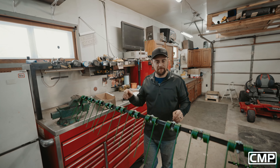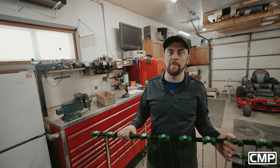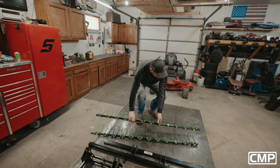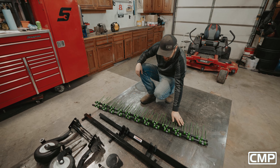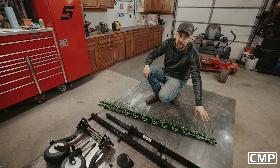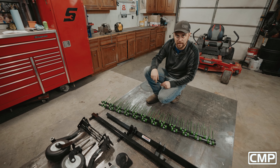Although you may not have a vise, there's nothing wrong with cutting the box open and using that as a workstation on your garage floor. When we line up the ends of the two tine bars, we can see we have maximum coverage — none of the tines are overlapping one another. That is the main purpose for those tine bars being flipped 180 degrees.